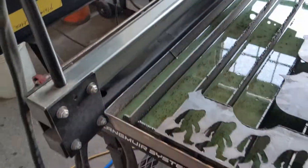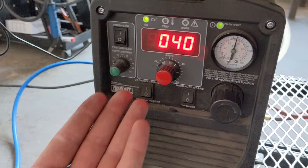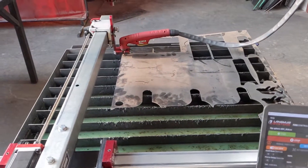Alright, dry run looked good, so I'm just going to go adjust the power settings on the plasma cutter. I'm cutting 16 gauge, so it's at 40 — that's probably where it should be. My speed is about 180 inches per minute. We'll see how it goes.